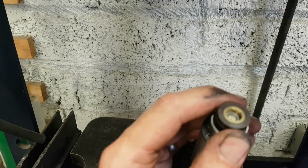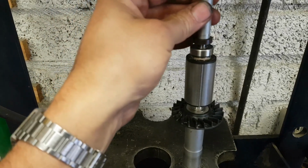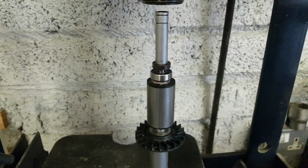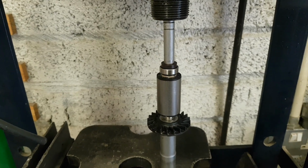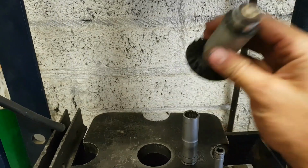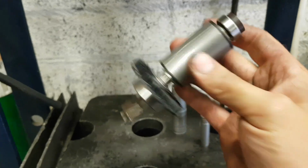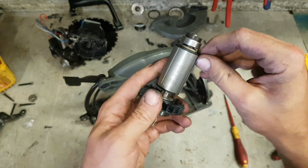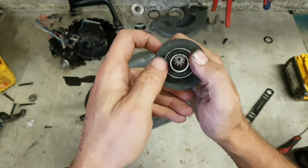Now, be sure not to damage the stacked tacho. Only press on the brass, only the brass. Don't over tighten it neither. That's it. One armature, new bearings. So this will now run a whole lot smoother, with those two new bearings. And use rubber seal bearings as well, don't use the steel metal shielded.